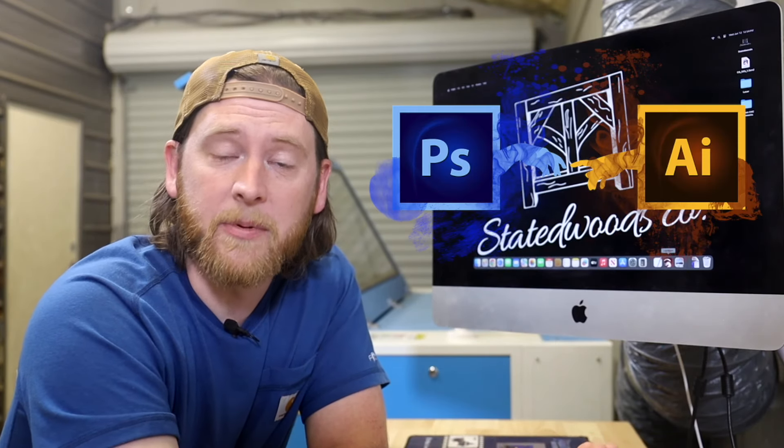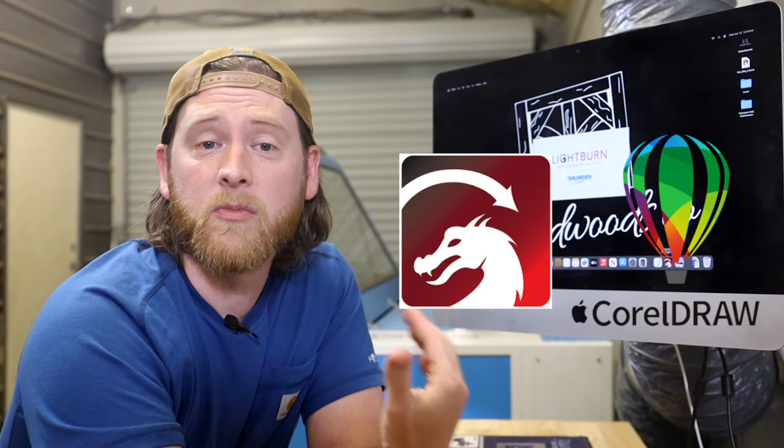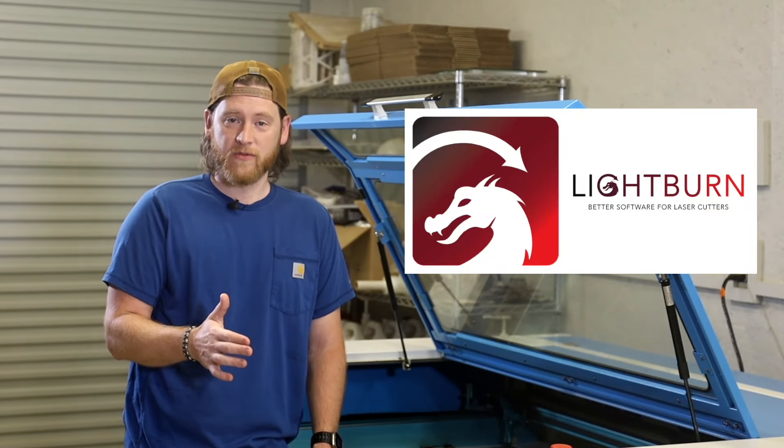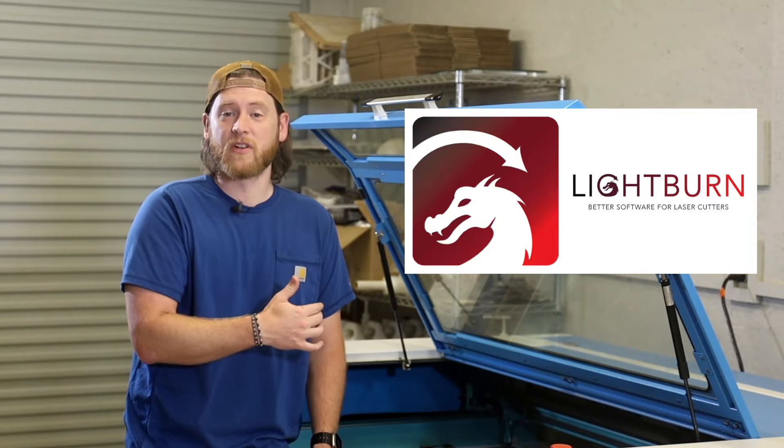Now a laser is only as good as what you tell it to do. There are softwares out there that can make this very easy. A lot of people think that the most daunting thing about lasers is the laser itself, but really the software is where your learning curve comes into play. There are several types of software you will need to create files to run on the laser. You have design programs like Photoshop and Adobe Illustrator used to create your graphics, and then you have software like Lightburn or CorelDRAW that communicate your drawings to your laser. For our lasers we use Lightburn — probably the most popular software on the market. You can create whatever graphic, logo, or photo in your design file and bring it into Lightburn for cutting. You don't have to be a graphic designer or an artist to use a laser.